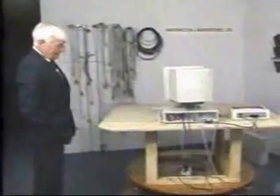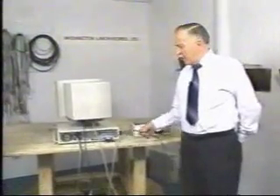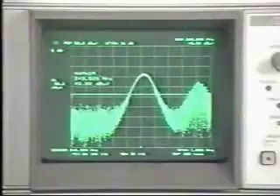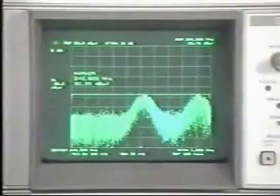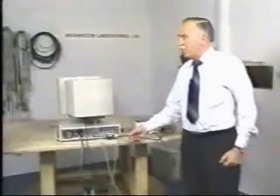If you notice now, with the table in this position, the spectrum analyzer indicates the maximum level of radiation. It turns out that the problem in this case is this particular cable. And you notice, as I move this cable up and down and move my hand along the cable, that the level of emission seems to change, showing the sensitivity of that emission to this cable.